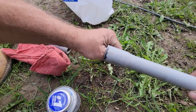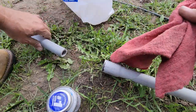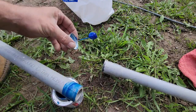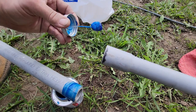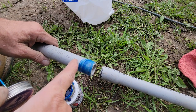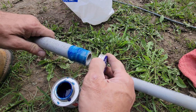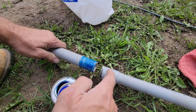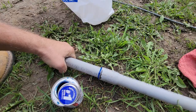The beautiful thing about the flared end on this electrical conduit is it's already got the flare — I don't need a coupler, just make sure the pipes are clean. This is a little bit deeper of a connection, and that's why electrical conduit has longer flares, so this piece of pipe will actually go in almost two inches. So I'm going to add some more glue because this is going to be an electrical conduit and there's no chance of water getting in here.